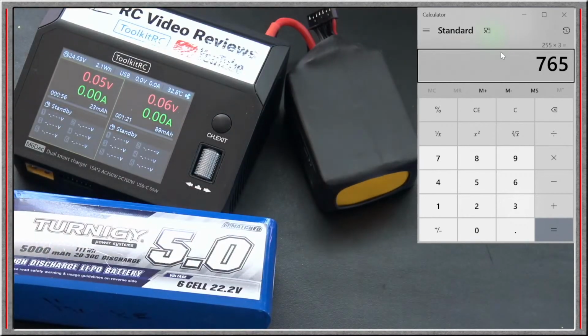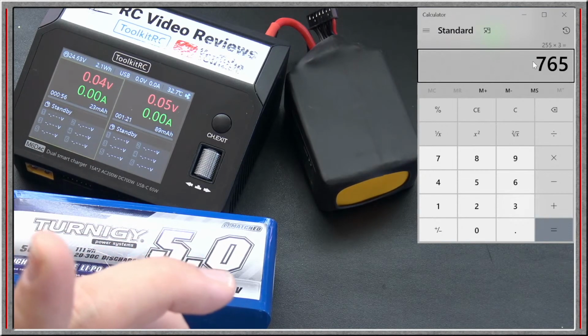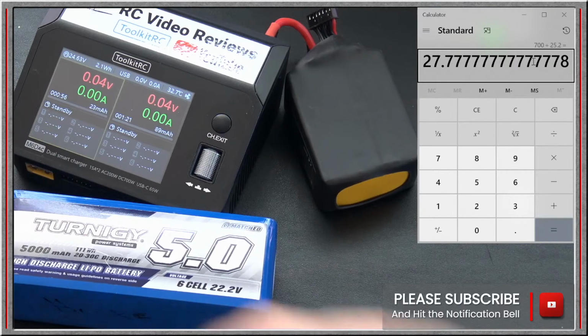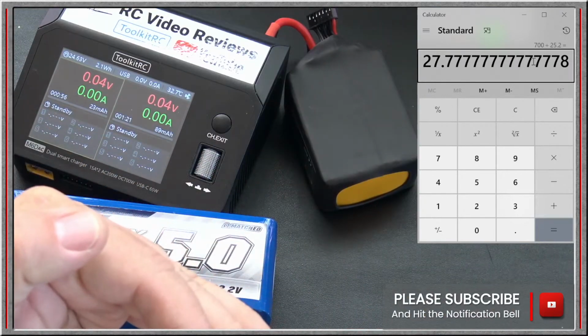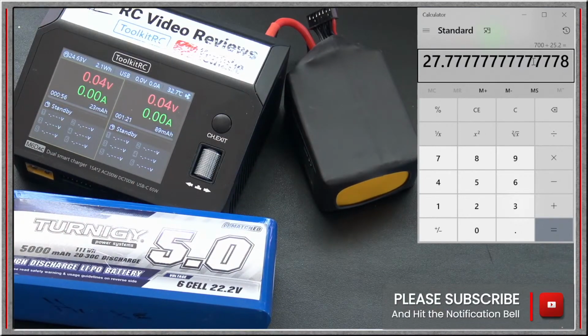You're on it. So 765 watts. Now that's actually too high. So the other way we have to do this is we have to take 700 watts, which is the peak, divide it by 25.2, and that tells us we can use a max of 27 amps. So that's what we're going to do. 27 amps is below 2C. 2C would be 30. This is slightly below 2C. So I'm going to set it at 27 amps.